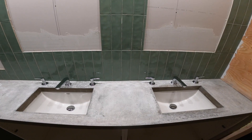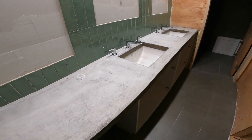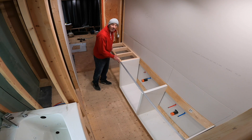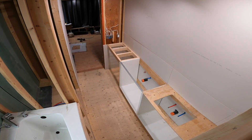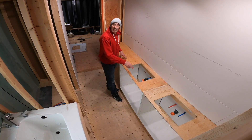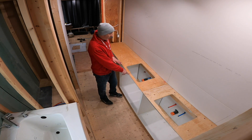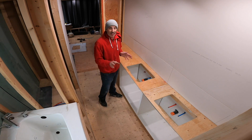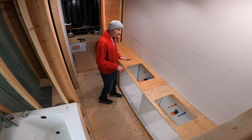I'm going to show you the exact step-by-step I take to do undermount sinks and the whole process to form up the concrete countertops. To start, I bring in some half-inch plywood that I've measured for the full width from edge to edge, measuring to the front of the gable of my cabinets. I've got some sink cutouts already done because I was working on my sink centers — sometimes the decal is off-center, so I like to dry-fit and visualize what's going on to find my exact centers.